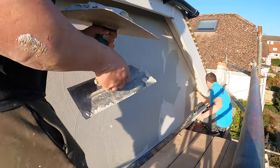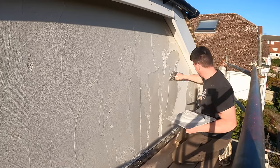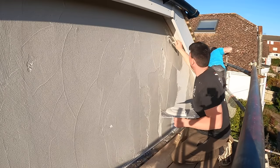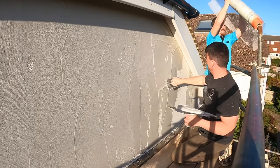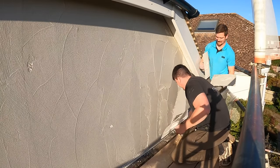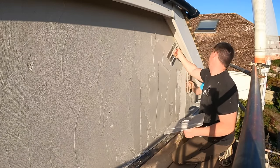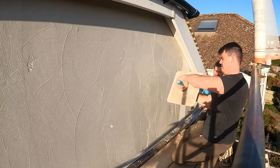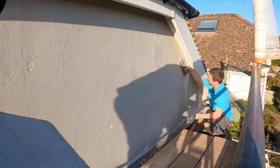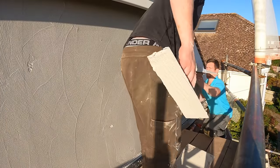That's going to allow us to get ahead of ourselves and it's not going to dry up too fast. We don't want this product at this stage to dry up or start to take up onto the boards. Here's my mate Charlie — we're rendering the whole house together so we just thought we'd do this gable end together as well. It does make sense to work with two people in a silicon-based rendering system. It works with two people all the way through — it just makes life so much easier. We're putting a very tight coat on, 3mm max.